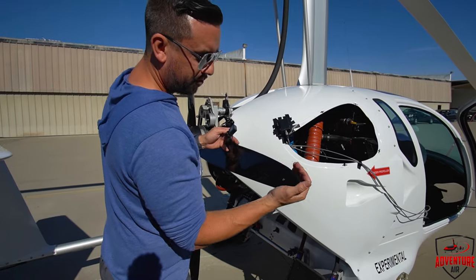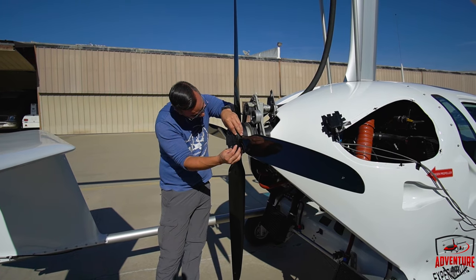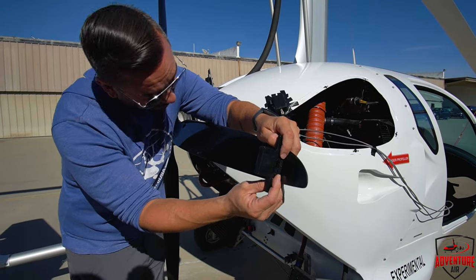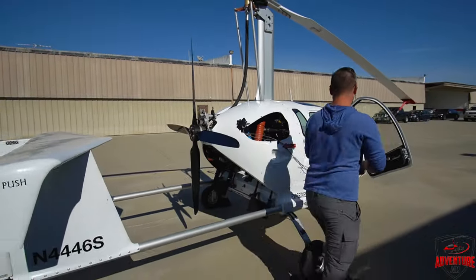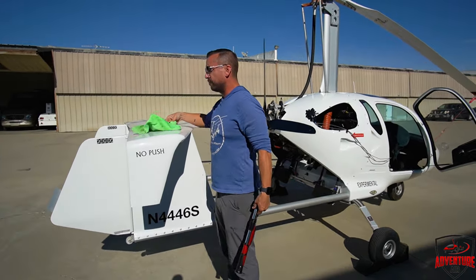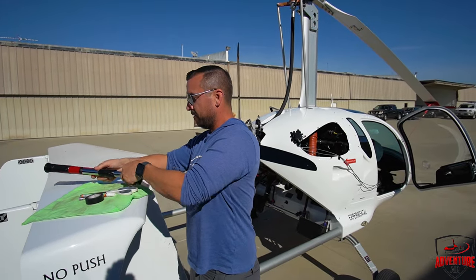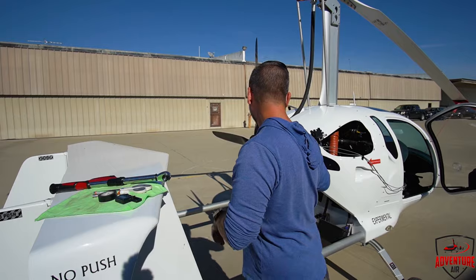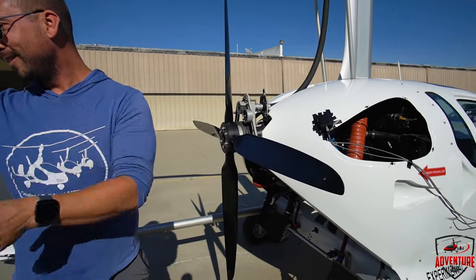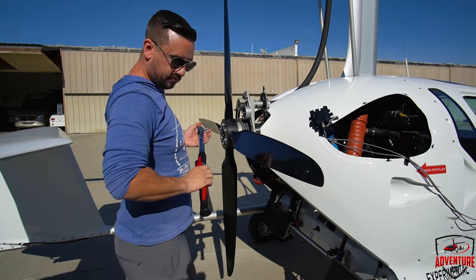This one's showing me 19.2. One of them showed me 18 — that'll be a big difference. A lot of times people just go and balance it, but then you find out the blades are out of phase, they're not pitched the same. That could fix your imbalance right there. Sometimes people add things like safety wire to the bolts that hold your propeller on — how much wire are they using, exactly the same? That throws it off. Some people forget a washer. A gram can make the whole difference.